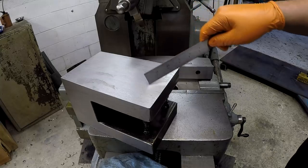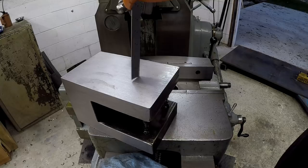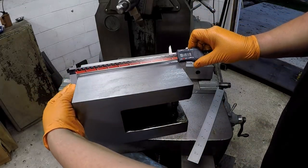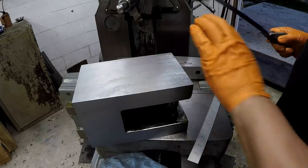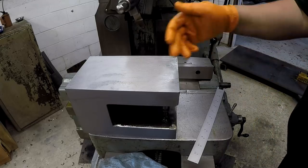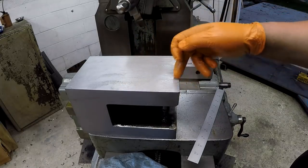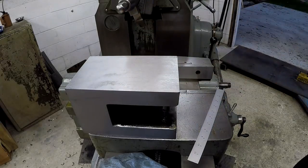Okay, our center hole for our pin is accurately located from the back. From here to the center is where we will measure for the hole. But using these calipers, we are right at 9.5 inches. See that? So we're just going to leave that alone just like it is. And another thing that I'm probably going to do is set this up in the milling machine and use the digital readout with the arc contouring feature to cut this 3-inch radius on there, but that'll be later on.